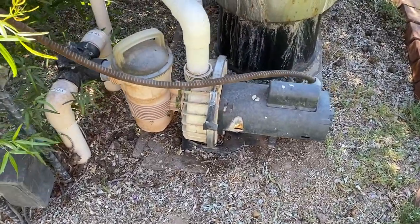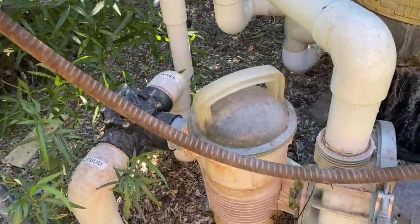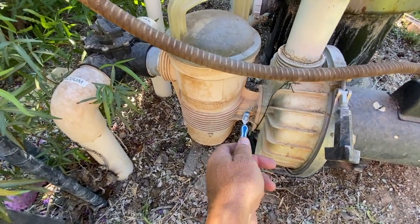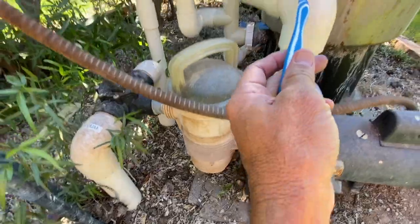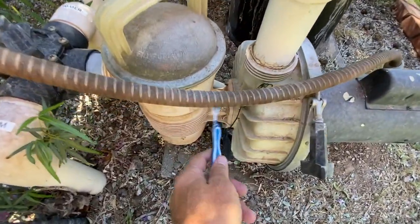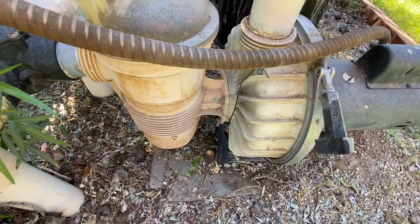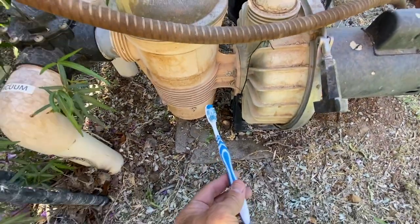This is one of my client's pools. To briefly go over the details: this is where the suction comes from — the pool water goes into the pump, and right inside here is where the impeller is. That impeller pulls water from the pool through the pump, up through this pipe, and forces it through the filter and out. This one has such a deep throat that the impeller is right at the end and it's really hard to reach with your fingers.